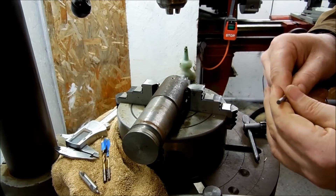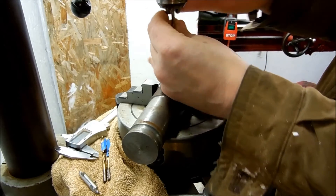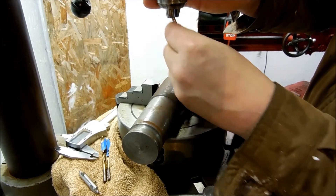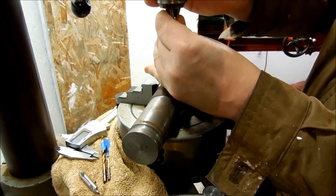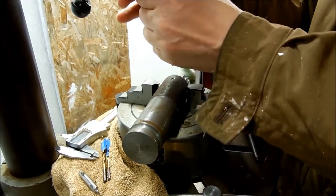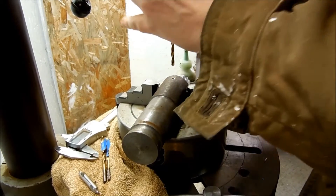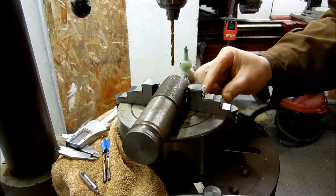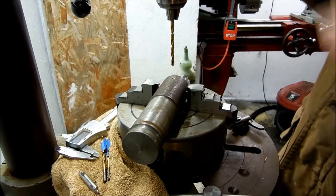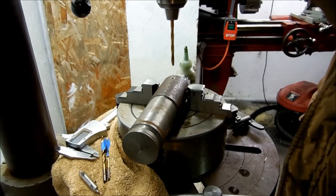Here's our 11/64ths. I'm going to go full depth — I can go right through this because it's a through hole. Now this does not have flats on it, but I've learned that when you have a drill bit with flats on it, in order to keep from chucking it in there crooked, you bring the chuck jaws just right over the flats before tightening down. You don't put it in there when it's really loose or else you're liable to put it in there crooked. I'm sure many of you know that, but I didn't.